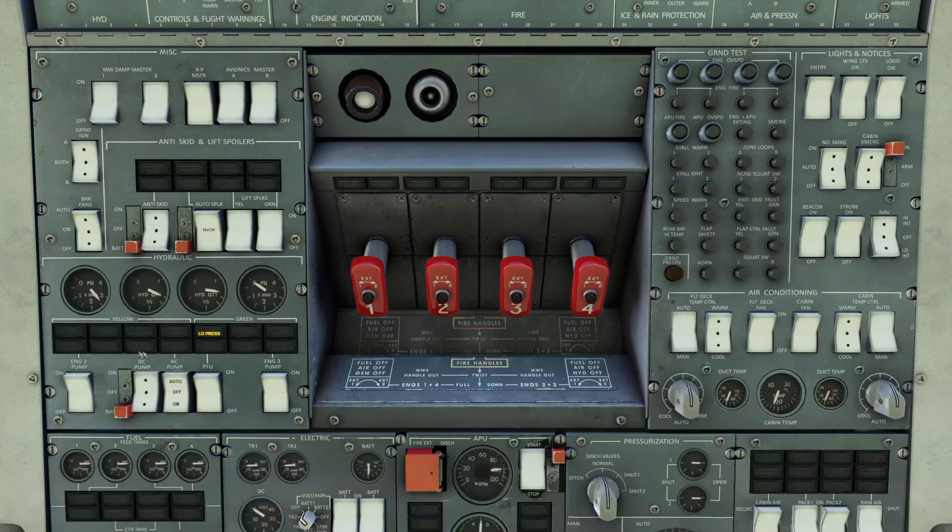And it's also pressurized the brake system, which is engaged at the moment for the parking brakes. So that light's gone out, and you can see we're just about 2,500, which is what we want to see. We're going to turn it off, and we'll see that drop, but the brakes are holding pressure, so that is a good thing, and it's going to drop back to zero. We're now going to turn the AC pump to on, and this will pull off the power provided by the APU and the engine generators. And hear it running. It's going to move a little bit quicker, and there we go.